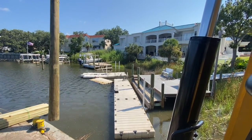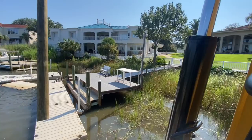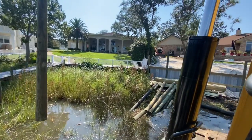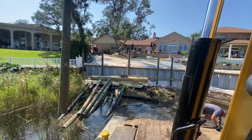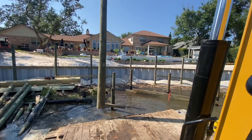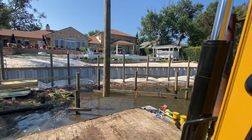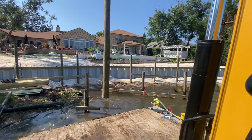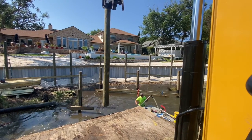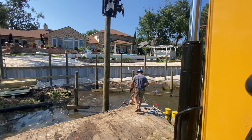30-foot piling in the air. Just in case there's any debris, because we ran into a lot of debris here at the upper end of this bayou, we try to get it out of the way. I want to shove the piling down, vibrate it down, and make sure it doesn't shoot off to a different location. We're setting this piling right in the middle of this 21-foot platform, which will give the jet ski a good place to swivel around and people to access the jet ski from the platform.